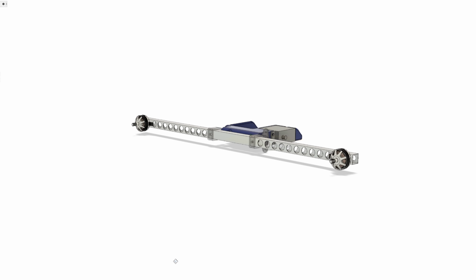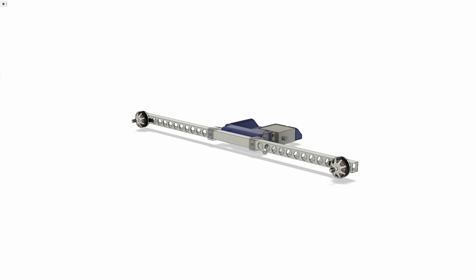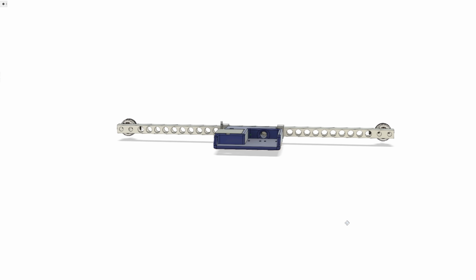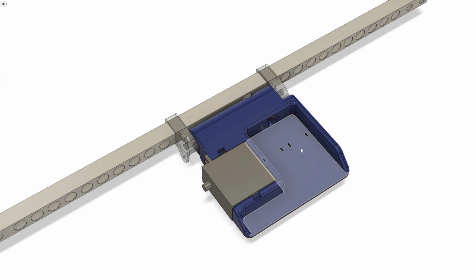As you can see, the motors are mounted on the ends of this aluminium square spar section, and I've designed lots of holes to be cut in this aluminium section, which I'll most likely be doing on the CNC machine. The wires for the motors will be routed through the centre of this aluminium spar section and come out through the 3D printed part where I'll mount the speed controllers.